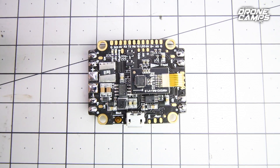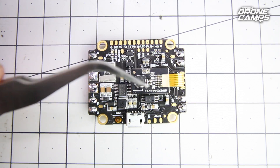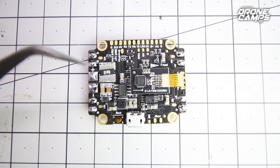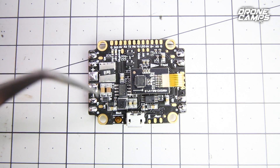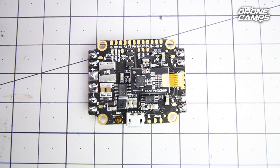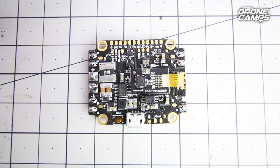Not only do you have a nice soft-mounted floating IMU processor right here, we also have a huge voltage range on this flight controller — from 7 to 42 volts, up to 6S battery. So if you have ESCs that can support up to 6S, you can run this like a monster. 120 continuous amps is huge, so tons of power available on this flight controller.